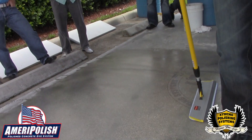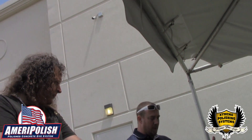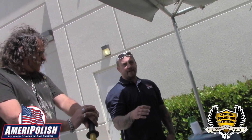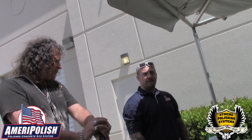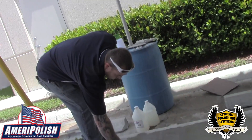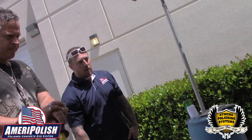Is this considered a topical? No, this is all penetrating. At World of Concrete this year, we did a gray slab - about a 4x4 or 3x3. We had an artist come by and draw the Arkansas Razorback logo, taped it all off with blue tape, hand cut it out freehand. Then we took the SR2, sprayed it, and peeled the tape off - put the slab out on display. There was nothing visible on it. Then I took a bottle of water, dumped it on it, and that's when you could see the Razorback appear. This is a very low viscosity, low solids product.